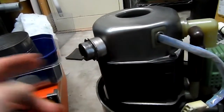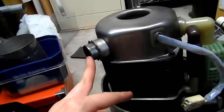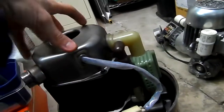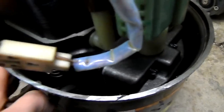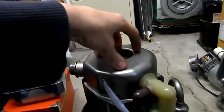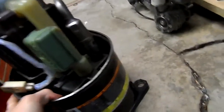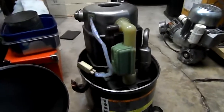That's your suction input here — comes from the evaporator coil or the accumulator, not sure whether that system had an accumulator, but it comes in through there. It cools the motor, which is under this cover here, through this plastic muffler and then into the cylinder head which you can see down there. It all just sits on two springs, with one up inside the top of the casing. I've cut the discharge line so we're ready to lift this thing out of the casing and pull it to bits.